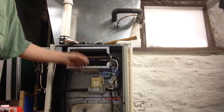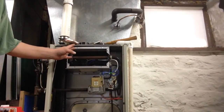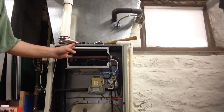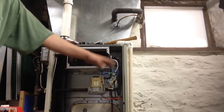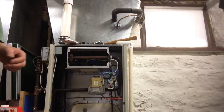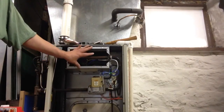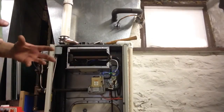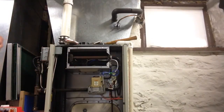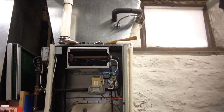You should have one click for the pilot igniter and pilot, and then another click — your gas valve, the main valve, should come on and light the furnace gently. So we have kind of an exploding furnace here, and when the cover's on it'll be like a large thump. And of course that's not right, so we're going to replace the gas valve on here.